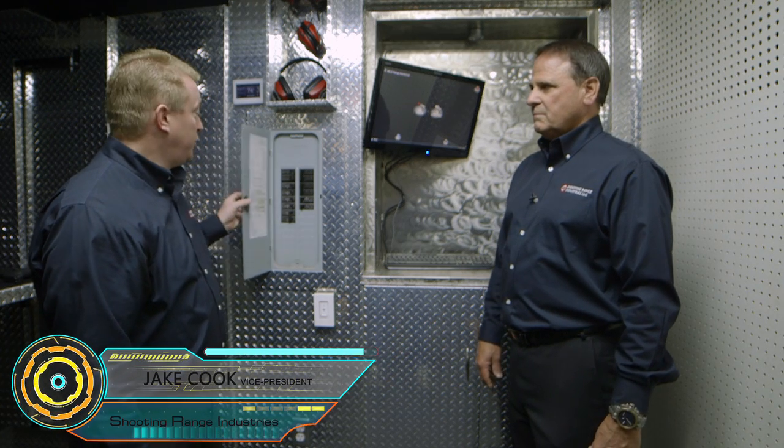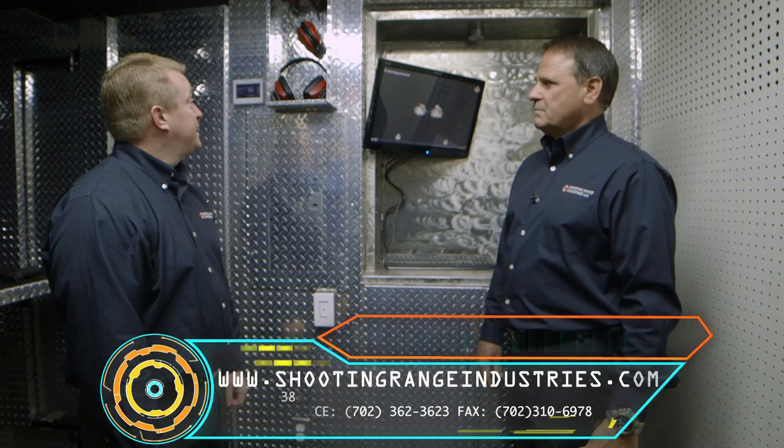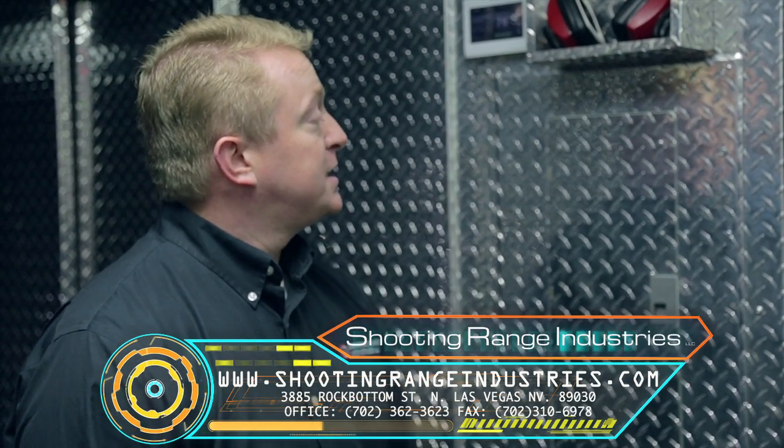We have a complete integrated electrical system. The electrical system is set up to be a 120-volt that varies in amperage size from 100 to 150 amp, depending on location around the country, around the world. We also integrate natural gas as well as other features for the ventilation. The ventilation is controlled from this single point thermostat. It's completely interlocked, all the HVAC equipment together, to where it's a one button setup to start the system up. All the fans, all the systems come on, and it's all tied into the HEPA filtration, the MagnaHelic gauges, and the exhaust of the system itself.